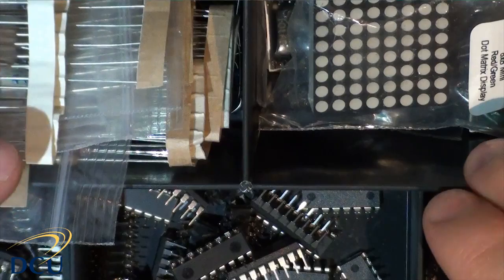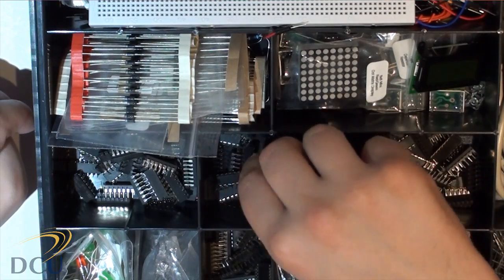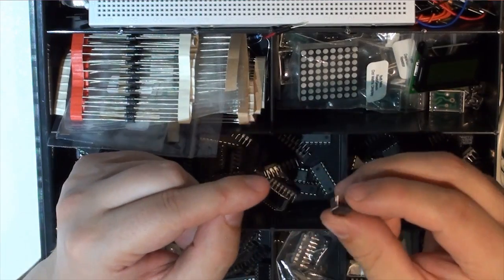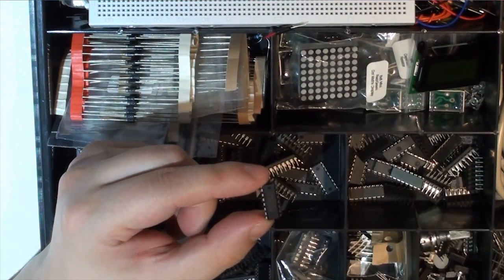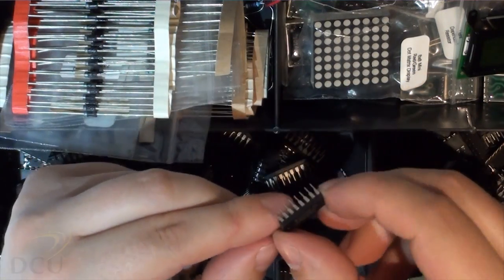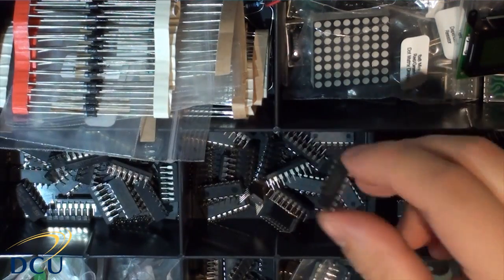There are also several boxes of ICs — each box is segregated in some way. Try not to touch the pins on the ICs as they're somewhat statically sensitive. If you can ground yourself by touching a radiator or something connected to ground, it will help reduce static effects. Each IC is different and has a number on it. I've put the numbers on the figure to help, but you still have to look each one up as each IC has a different pin-out and different points for connecting voltage. Don't connect an IC until you've looked at the datasheet or a figure I've supplied.